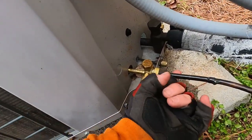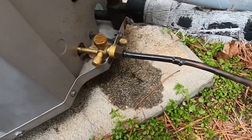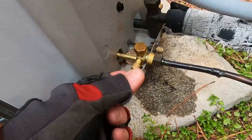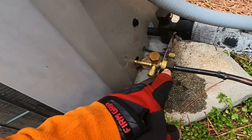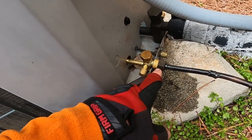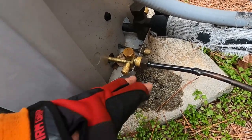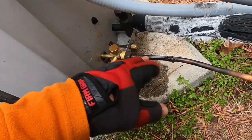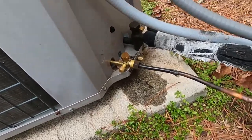Because of all this oil that has dripped down here — that's probably water where it's been freezing. Tempstar puts their metering device for the outdoor unit right here, and this is a Carrier ICP product. So I'm guessing we're going to have a leak somewhere in here. Let's hook up to it and see what these pressures are.